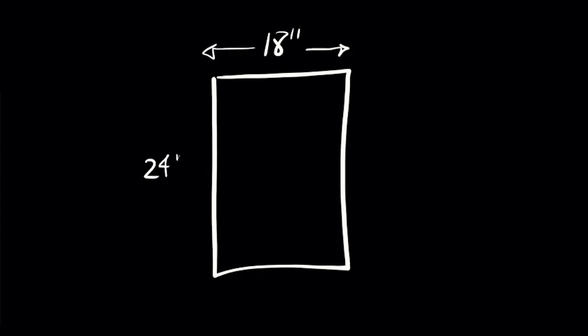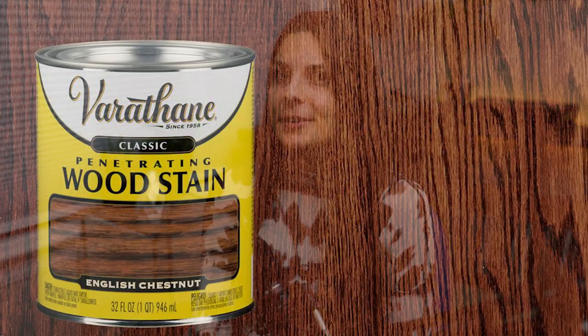First up you're going to need some materials and some tools. To make my diffuser, which is 18 by 24 inches, you're going to need the following: four 2x2x8s — I used knotty pine because it's cheap in Canada and because I was going to be staining it, so having that variation with the knots and texture would look really cool. You can really just use whatever is available where you are. You'll also need some stain — I went with a chestnut color — some good quality wood glue, and some steel picture hanging wire with the hardware to go with it.